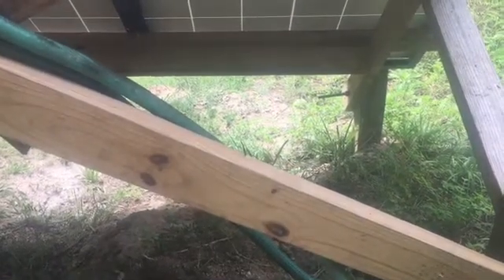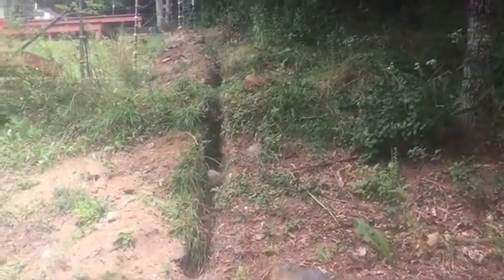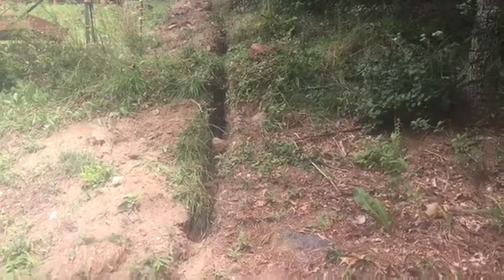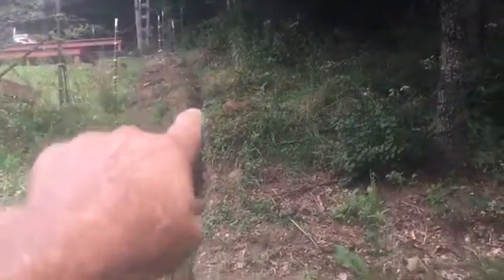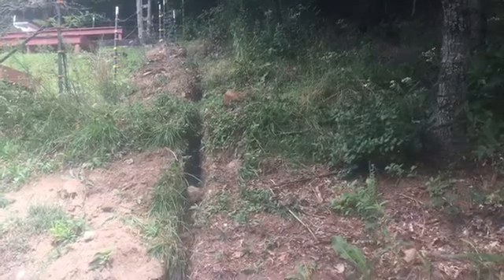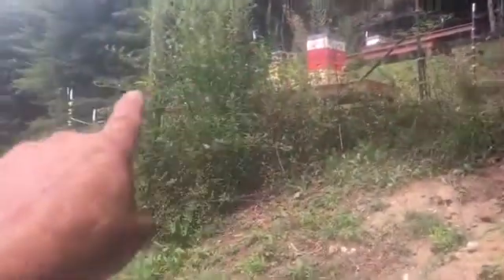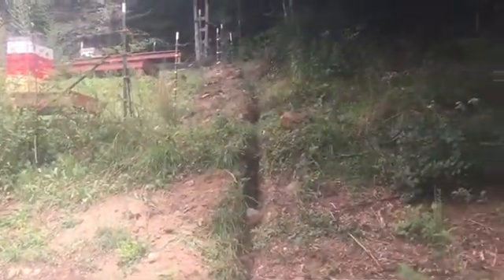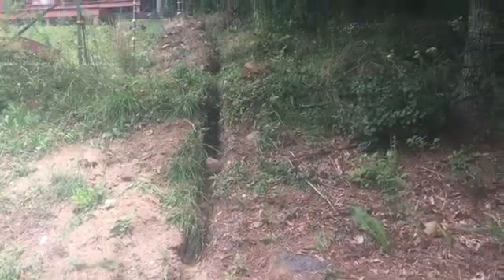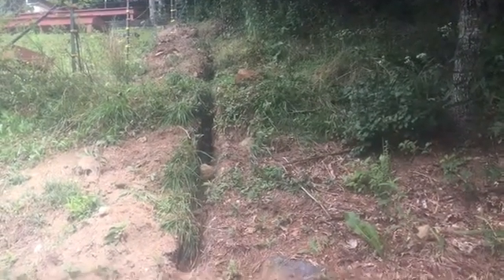I think we've got everything caught up here. Let's head up to the top of the hill and let me show you the tank in place. From the well head all the way up to this tank on this side, the fill line to the tank is just under 600 feet of pipe — linear feet going up to get 80-some feet high. From the tank coming back down to the house is over 600 feet of pipe. Except for a few small sections, this is actually the first time I didn't have to dig the trench, and it was kind of nice.